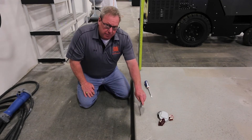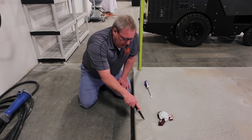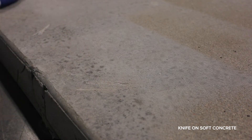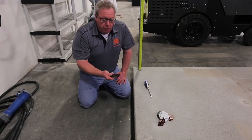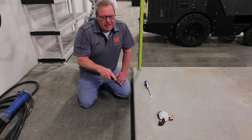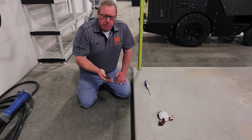Just the opposite: sitting on top of that hard concrete slab is the soft concrete slab. I'm going to take my knife and run it back and forth just like before. You can see and hear that I'm actually digging a trench very easily, getting a lot of dust, with very little effort. That tells me this is very soft. In the middle would be if scraping back and forth digs in just a little and makes just a little dust — then you can determine it's medium concrete.